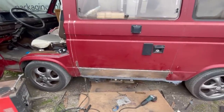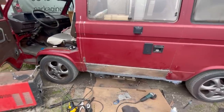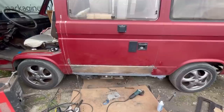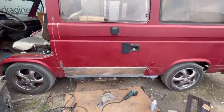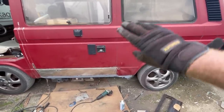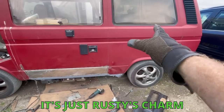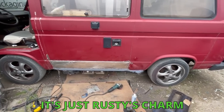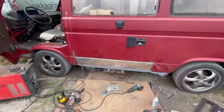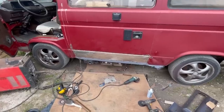Managed to get inside and plug weld those in. Put a couple of tacks down the sides on the outside - a bit of sealant will be fine. I need to see if I can mix up some filler if I've got any. That's alright - it's a camper van. The rear panels are awful as well because I did them on my drive years ago - you can see scratch marks in them from the grinder, and they're wavy as anything. They need replacing really rather than just blocking them.